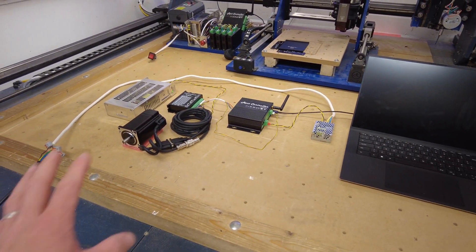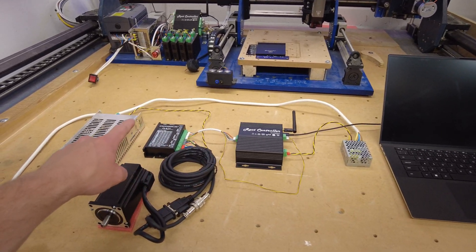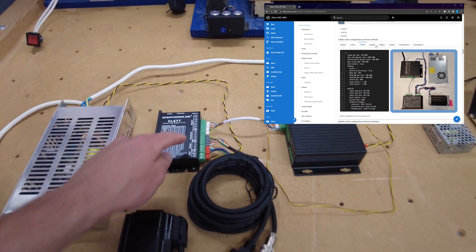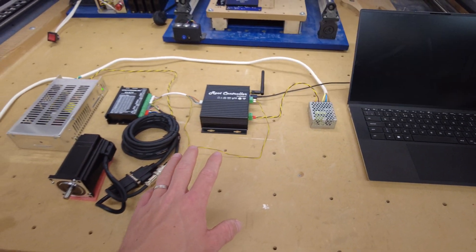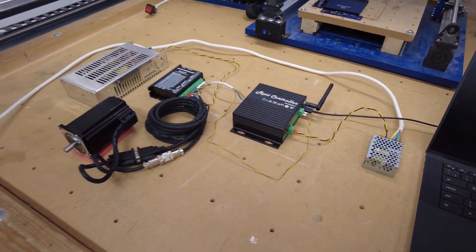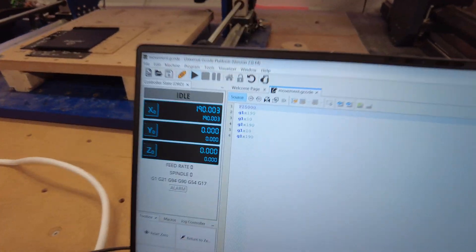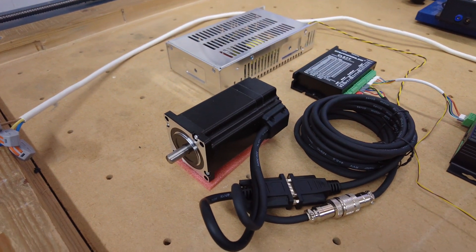Let me do a quick demo on how this all works. The configuration is basically the same stepper motor port — the wiring is very similar to the previous video. If you're unsure, please check out the wiki; I'll be adding more explanation on how to interface between the router controller and the stepper motor driver. The only addition is this fault signal — I've added one extra line to the configuration to watch when that changes state and flag a fault signal. I've got my laptop connected via USB, and I've got a very simple G-code that I'm going to press play on.